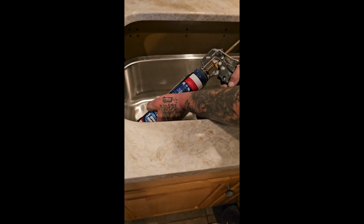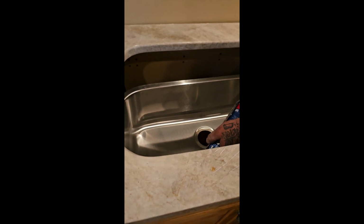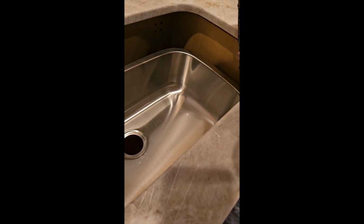When the customer was telling me the plumber said he used brackets, not glue, I was like, really? You don't want silicone? That's your main strength. However you say it. Y'all know I'm from the country. But anyways, we run our perimeter bead of silicone all the way around it. Then we put the slits in it. Let me see. The slits might be behind the cabinet. Let me see it right there. All right. So the slits are behind the cabinet.